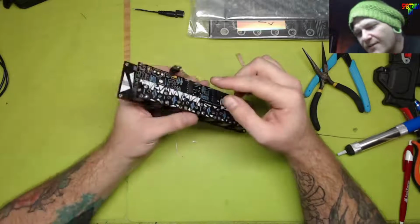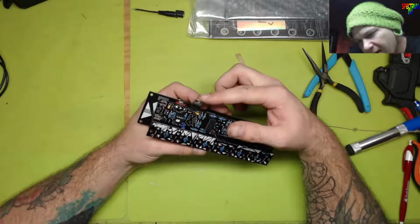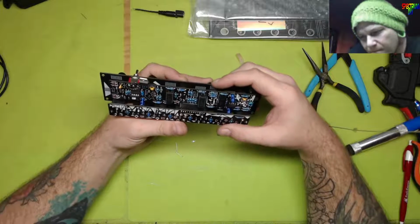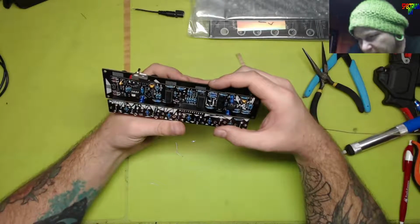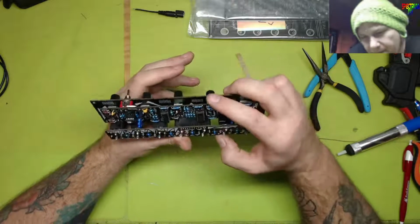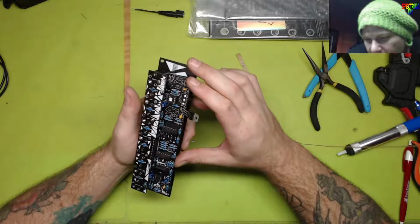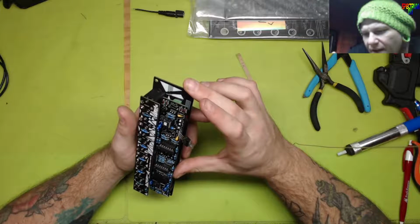I got the pinout correct, right? It's 1, 2, 3 across the front, and pin 1 is square. So with this thing being hot like that, or rather getting warm, I'm willing to bet that that is the one. I'm going to actually have to use the right voltage regulator. I don't see anything that I missed. I'm going to look. So far, the diodes are all correct.